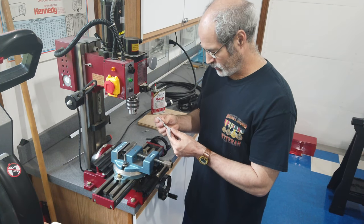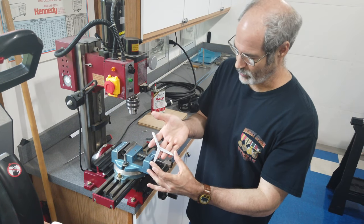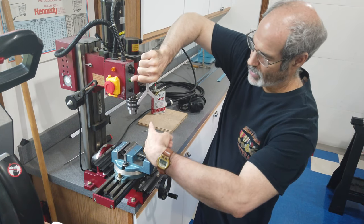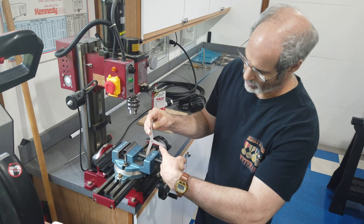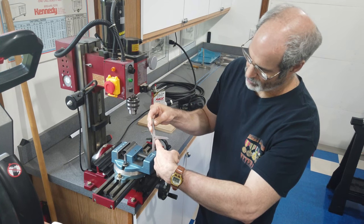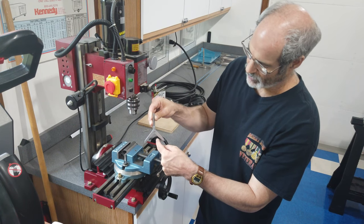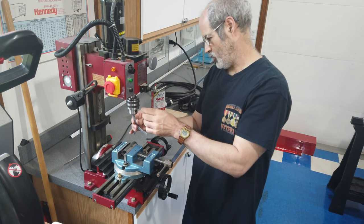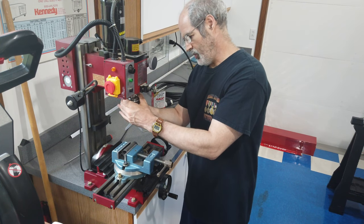For this purpose I just want to show you how I'm going to do it with the tools that I have. The first thing I have is this center finder for round stock. You chuck this in your drill press, your round stock will be in your vise, and you come down and find your round stock — it will deflect this arm. Let me get this in snug so it doesn't fall out.